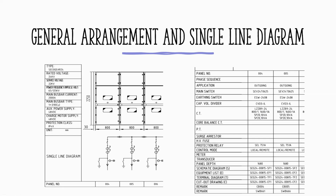It means that it is designed to measure current at a very high fault current. Like for example, if you have 800:1, so the primary is 800 times 20. So if you multiply by 20, you can go to kiloamps, but still it's within 5% error. So that's the difference. And you have 10 VA burden.